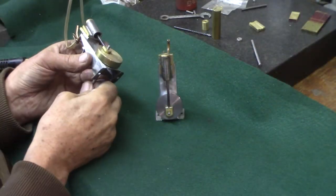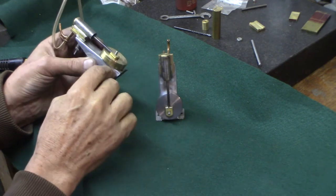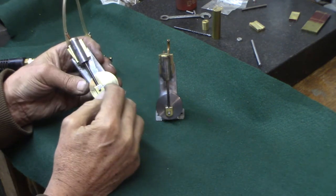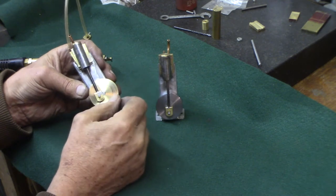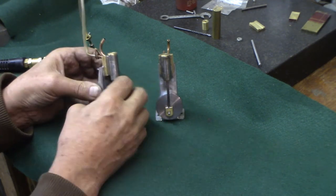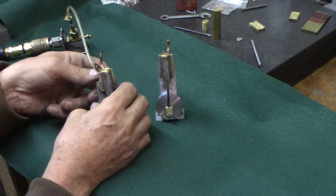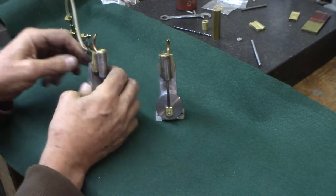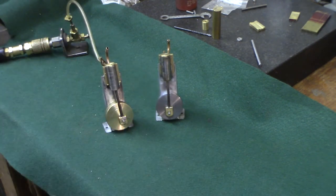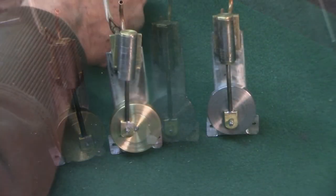I skinned down the bearing a little bit on the front of the engine to let the flywheel go closer to the frame. I had a rim on this flywheel, so I just shaved off that rim. It moves pretty freely, and this spring is kind of not very strong, so I'll have to find another spring. In the meantime I put a spacer on there and tightened it up. I'm going to turn on the air now.